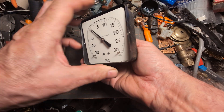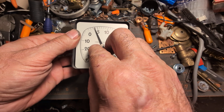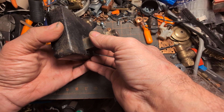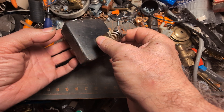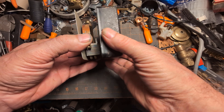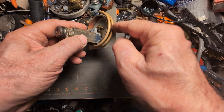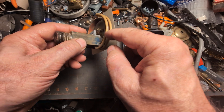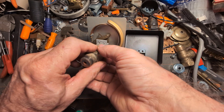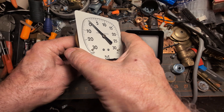Occasionally on older boilers you'll see something like this — you'll see the label 'internal siphon gauge.' Rather than having the siphon applied directly to the boiler block, this one is half inch in this particular case. What they have is the steam siphon — the pigtail — is here inside, which captures the water and allows the gauge to be protected from the direct action of the steam. These are very ruggedly built and last a very long time.